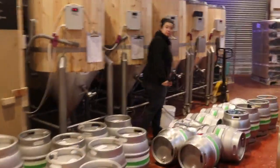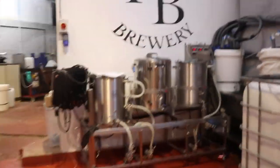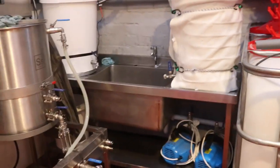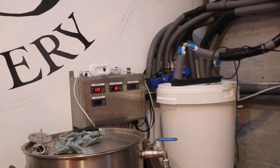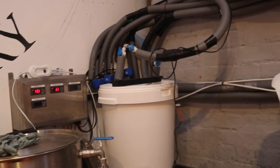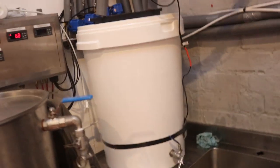It took us all day, but the pilot kit is back in position, the sink and the fermenters are hooked up. It's much more compact and it's going to be really quite easy to use. The coolers are on and they're chilling this beer down to about four and a half degrees to drop the yeast out of suspension, and then we should be ready to pop this stuff into a few bottles and do some tasting.